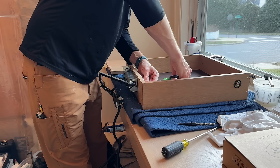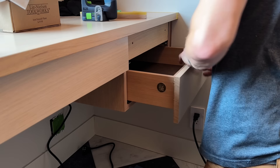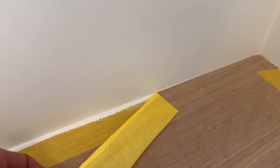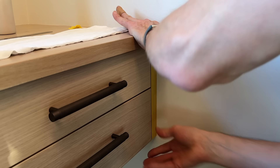And now for the final install. I know this is day four, but there were only a couple of hours on a couple of different days, so it wasn't like I was there eight to ten hours doing an install. Once the docking drawer was back installed and the new drawers were in, I could install the drawer fronts and then move on to the handles that the client supplied. This handy little jig from True Position Tools makes quick work of accurate handle placement. It just so happens these drawer pulls that the client picked match that brown leather perfectly — how serendipitous. And as promised, here's the reveal — peeling the tape off showing that those minor gaps completely disappeared after caulk and paint. The one final thing was installing the little filler strip on the end using a combination of PVA glue and CA glue for fast set.